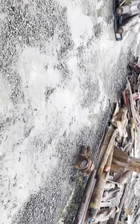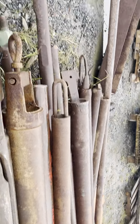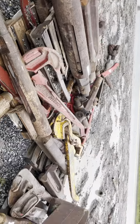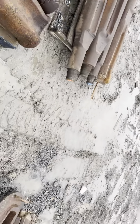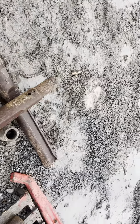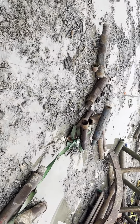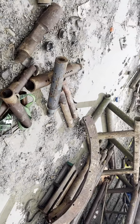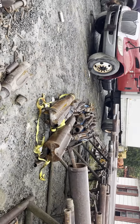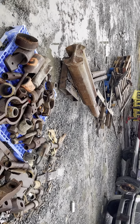Thread protectors are needed even up on the trailer, but let's do the stuff on the ground first — that's more important. Any thread protectors you find laying around: grease them, screw them on. Stuff at ground level is first priority, pallet level is second, up on the racking is third — you've got most of the racking done already, so that's not even an issue. Like this stuff should totally have protectors on it, as should this stuff, as should this stuff. I'm guilty of removing some of them because I needed to identify the threads. That row right there really needs thread protectors, and that big bit really, really should have a greased thread protector on it.